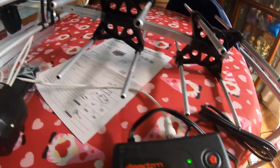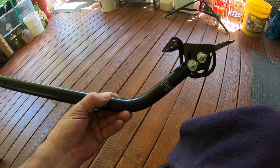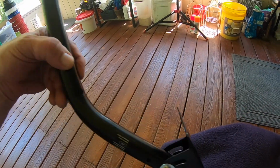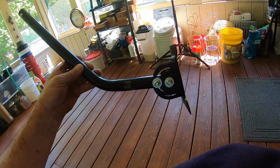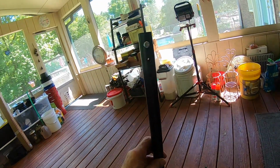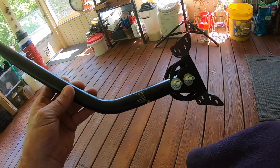And then the lines coming out, you have the VHF and the UHF hooked into it. It all comes down through a balun and a common line. And this is the mount for going on the side of the house to get past the jog of the edge of the house or the gutters that you have to go by. So that's what the antenna is going to be going on, and it's going to be up about 20 feet.